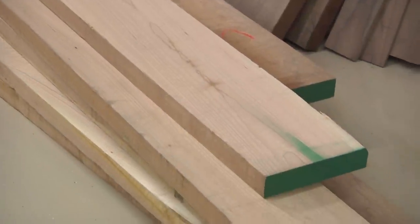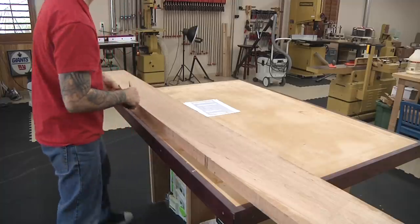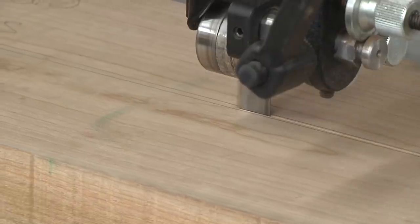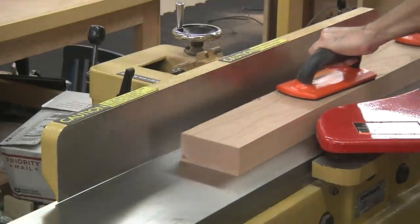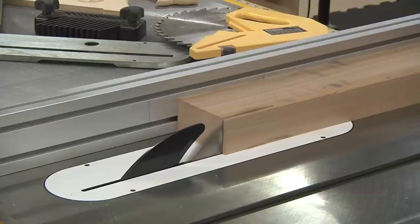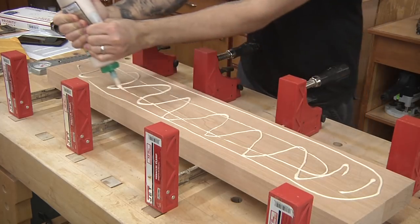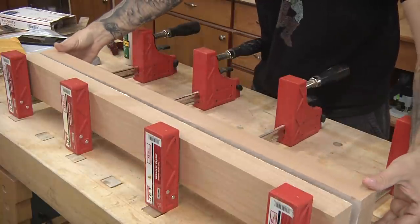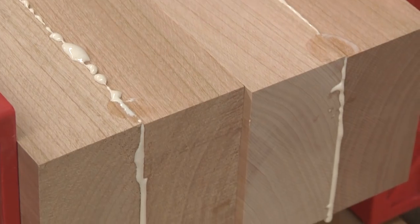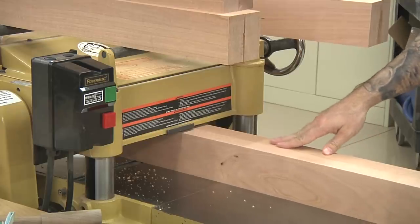All right, let's get to it. We'll get this party started with some nice eight-quarter cherry stock, and the first order of business is the legs. I'm using boards that are wide enough to produce both leg halves side-by-side for the best grain and color match. I cut the boards to rough length and then split the boards down the middle. Each board is then milled flat and square. Since the legs will be three and a quarter inches square, I trim the boards to three and a half inches, giving me plenty of room for cleanup after the halves are glued together. Things will go faster if you glue two legs at a time. A nice even bead of squeeze out lets me know that I have adequate glue coverage. Now I'll let those dry overnight. The legs can now be milled to three and a quarter inches square and cut to final length at the chop saw.